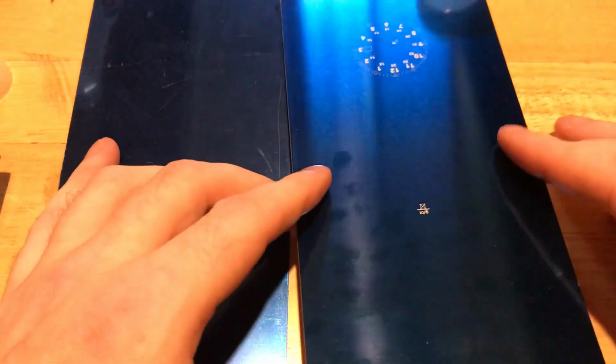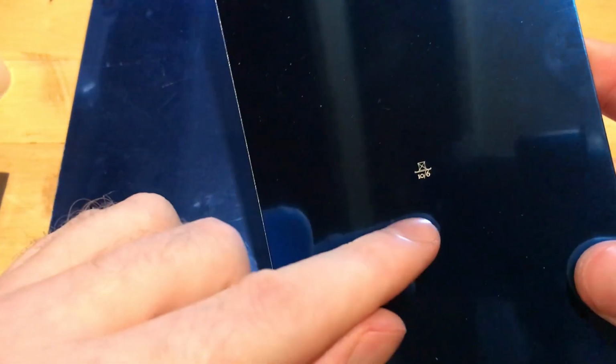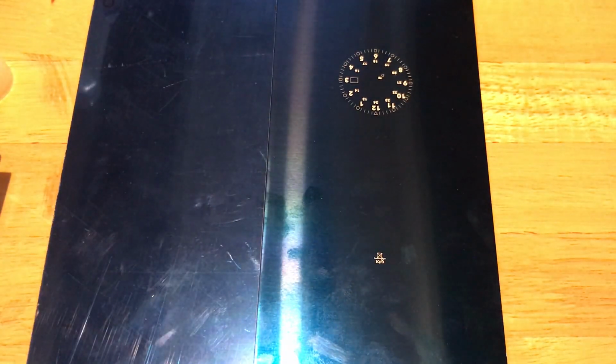But you can come up with a reasonable design if you're doing this with photo etching. I have a local manufacturer fairly close to me who has a laser that can do these etchings for me for relatively low cost, and so that's the route I've gone. I have cliches, which are these steel plates. You can get them in different materials, different thicknesses, etc., and I just get the plates and then they get etched with a laser. So they are basically perfect at whatever size you want to create this particular vector image. Again, this is quite tiny, but you can see my logo is quite detailed at a very small size. They can go on the dial at, say, 12 o'clock or wherever I want to put it on the dial.